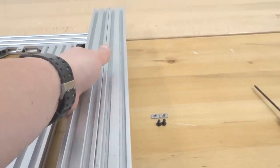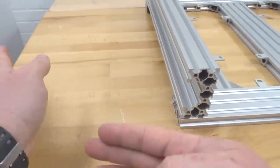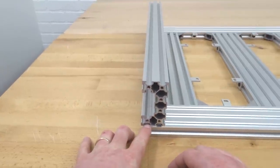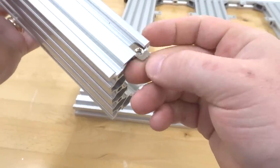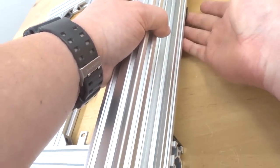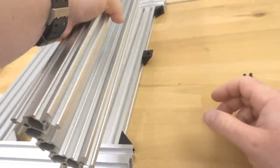We're going to need two of our 500 millimeter C-beams, as well as two of our 8 millimeter screws and two of our M5 T-nuts along with your ball driver. Grab one of our 500 C-beams and get an idea of where the placement is going to be on our base assembly. With the C-track facing outward for our plate on our Y-axis to run through, make sure our black angle corner connector can attach to the C-beam. This first track on the actual C here is where we're going to place our T-nut. Grab one M5 T-nut, place it within the track, and set this to the side. The same with our opposite C-beam — also for the Y-axis with the C facing outward — place the T-nut into the appropriate track and set it onto our assembly.